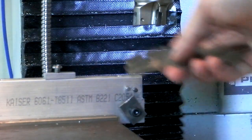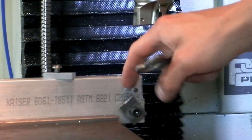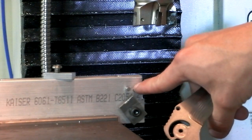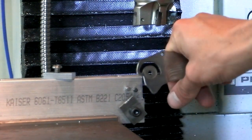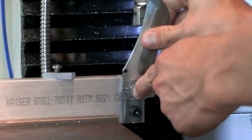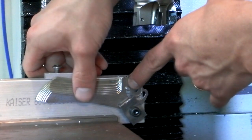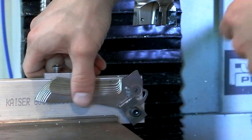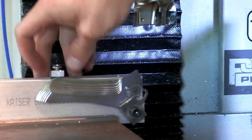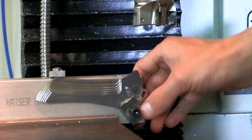So I have a very simple jig here — it's just a bar of aluminum with a clamp on top and a clamp right here. This is a 5/32nd dowel pin, and this here is a 3/16th dowel pin, so that they match up with the arc here. The precise location of these determines the angle at which the blade sits, and this lock bar tang needs to have an exact angle. So I basically put it on something like this, and you can see how this pin right here holds it back, so it's always repeatable into the same location — they're all going to be the same. Then this clamp basically just pushes down on the blade right at the tip, and this clamp holds it against the jig.